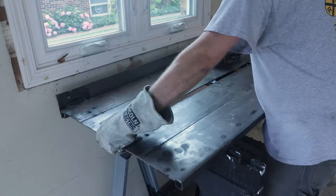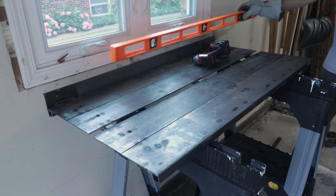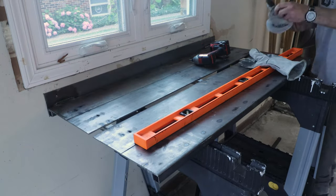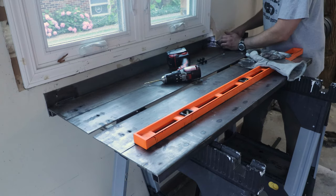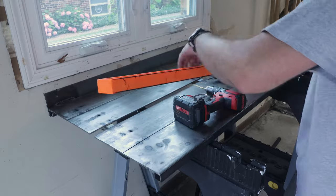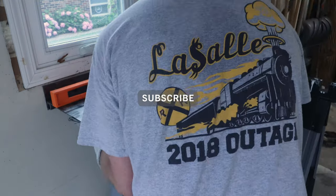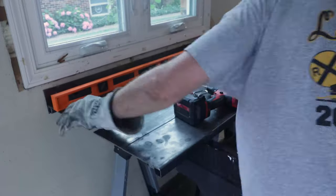In part 1, I left off with having finished the tabletop, with the next step being to attach it to the wall. Be sure to check part 1 to see what you missed. I used my sawhorses to lift the tabletop up to a comfortable working height for me, and line up the holes previously drilled in the back plate with the wall studs. With one end fastened to the wall, I leveled the table before attaching the remaining screws.